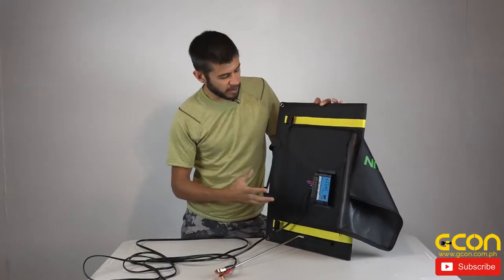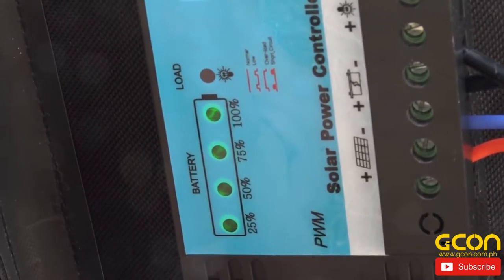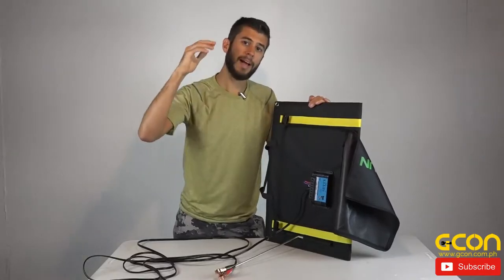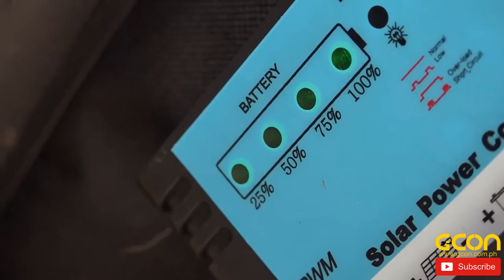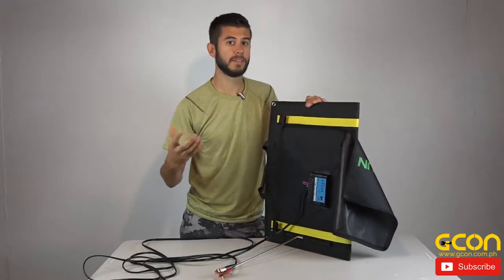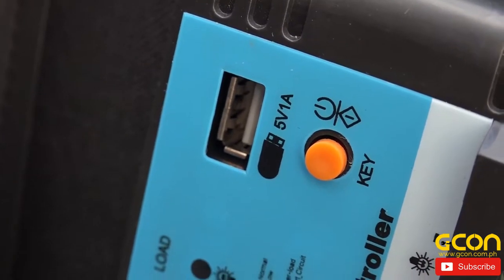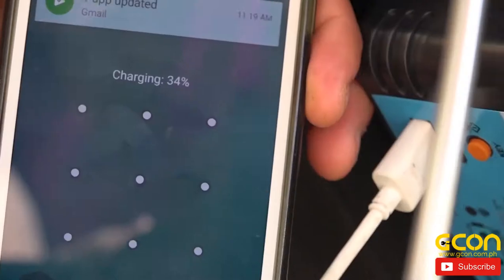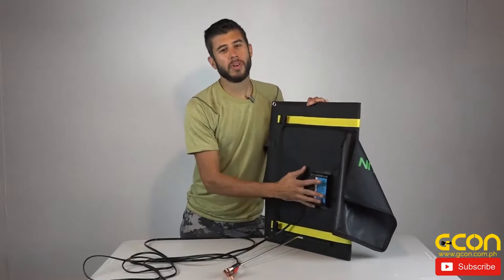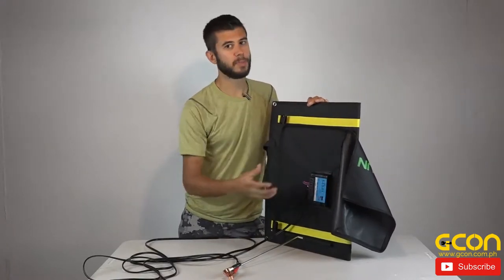Once hooked up to your battery and pointed into the sun, you're going to see on the PWM charge controller a little battery meter — it says 25, 50, 75 and 100% battery — indicating your current battery level and what it's charging up to. The green lights will blink as it's charging and go solid green when it reaches 100%. The PWM charge controller takes care of all the charging requirements, backing off on current when your battery is full so it doesn't overcharge. There is also a USB port on the charge controller, which is really neat — you can plug your phone or any USB device and get about one amp of power, charging devices directly from the solar panel system even without a battery. The charge controller also provides short and overcurrent protection.